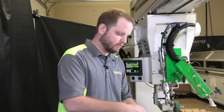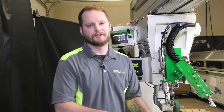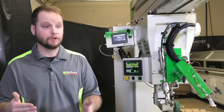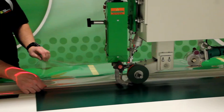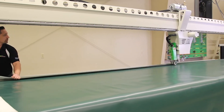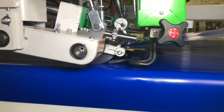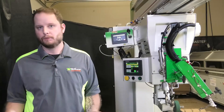If you're running something a little thicker and you're noticing your seam is just not there — you're not getting a good weld, it's not consistent — something you can also do is increase that air pressure, that flow of hot air going into the seam. If you're not getting enough airflow into the seam while it's moving down the track, you're not going to get a good weld.